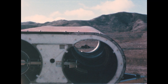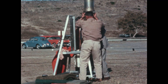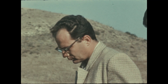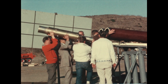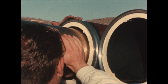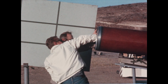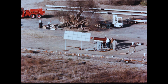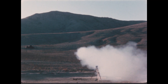The launcher was aimed at a target. The little rocket was carefully prepared and attached to the probe. It was adjusted and lined up properly — its thrust had to be lined up straight through the center of the probe. The probe was then inserted into the rifle barrel of the launcher. There was some force required. That little rocket is going to have to push hard to move the probe out of the launcher tube. The rocket was secured with a little flange at the back. When the little rocket ignites, it will push the flap and release the probe to move. Finally, the probe was ready to be fired.